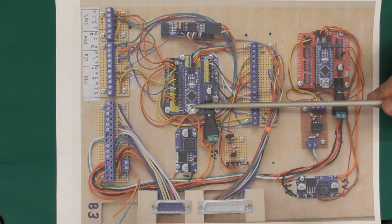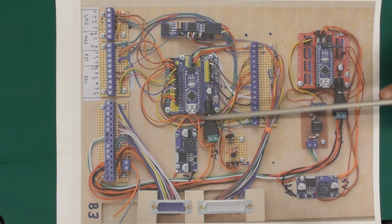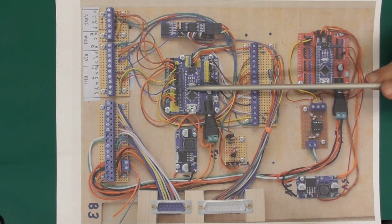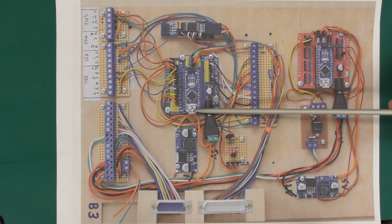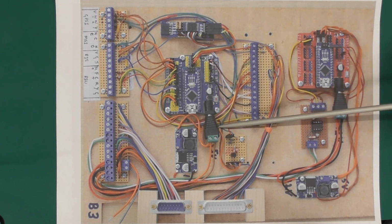This drives two signals. I always use them in the same way. I use them either to control an up and a down signal on two separate tracks that are unidirectional. And signal 1 in my nomenclature is always the up signal, and signal 2 is always the down signal. So that can be used like that, or you can program it through here. Again, I can program it with the computer to do different things, and you can specify that it uses a direction signal which goes into one of the pins, which you just flick a switch for, or you can have anything else driving it. It's any logic signal, it just goes from 0 to +5. And that allows you to run two signals on a track that is bidirectionally signalled.